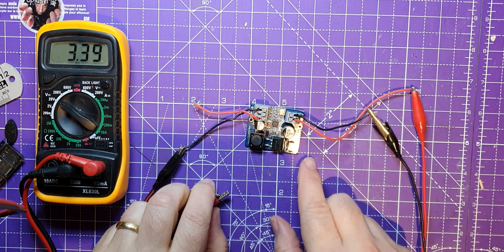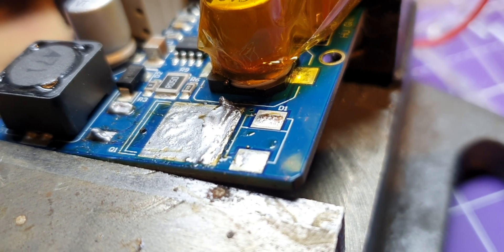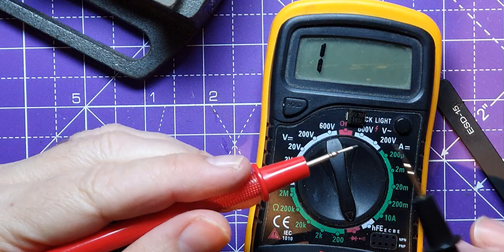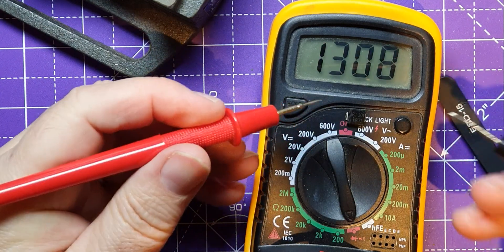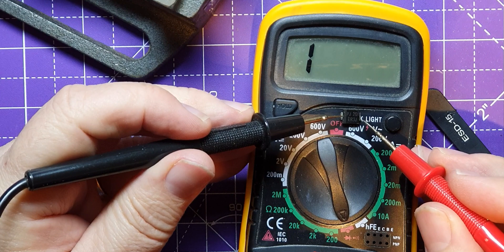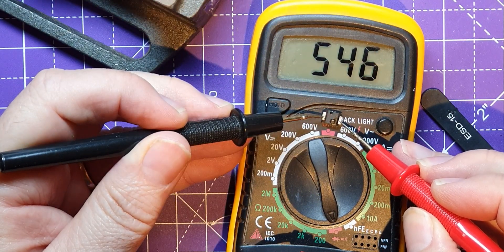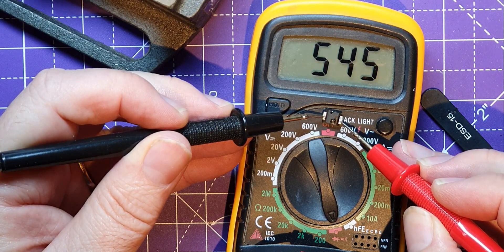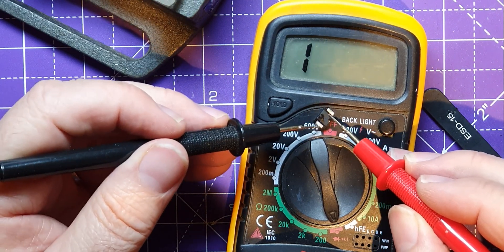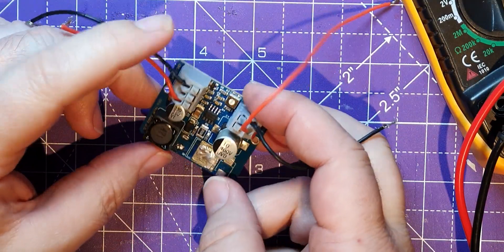Oh well, it was worth a go. I just noticed there's a diode next to it, so I've taken it off using hot air - it's a PJ20-something. On the diode setting: one way it lets nothing through, the other way it doesn't beep but it lets 5.4 through. Is that how a diode should work? I know it lets voltage through one way but not the other, so maybe that one is working. I'll see how much they are and maybe get another one.